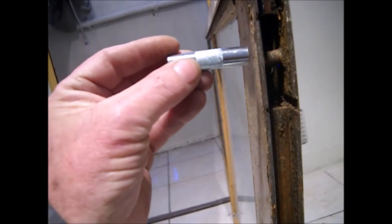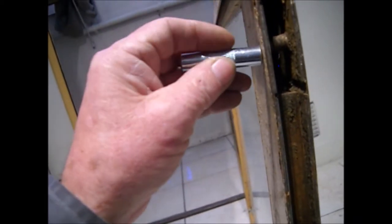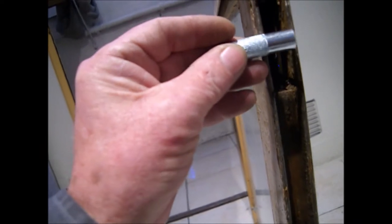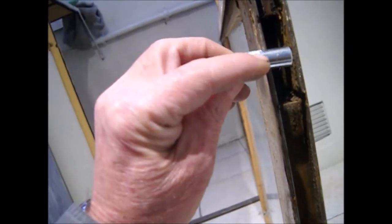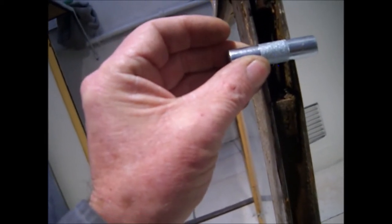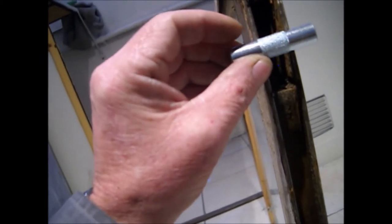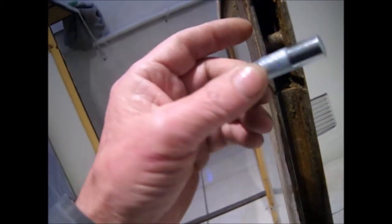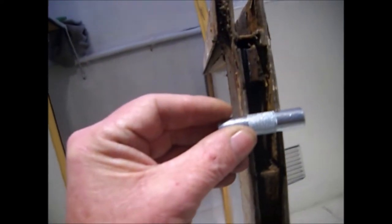We insert the new shaft with the wheel placed in position, and with a few blows of a hammer we force the wheel onto the grooved part of the shaft so it doesn't slip. And once that is ready, I have to weld the shaft to the holes, cutting off the projecting parts. This is the job.